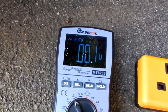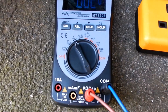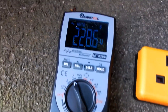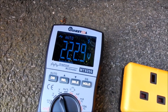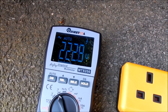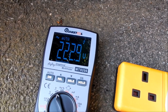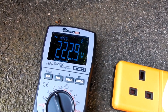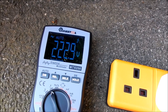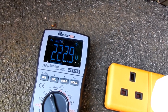Here's my graphical multimeter. Just checking these connections are not in the 10-amp setting, because that would be pretty disastrous. The voltage is quite low — 223 volts, well below 240. But that's still going to operate almost all pieces of equipment I'm likely to plug into this.